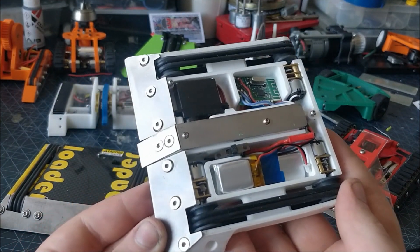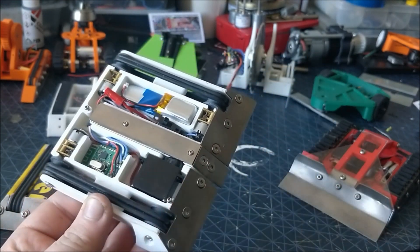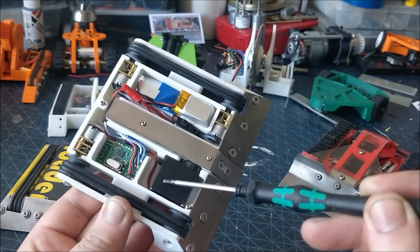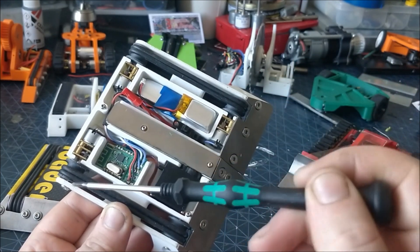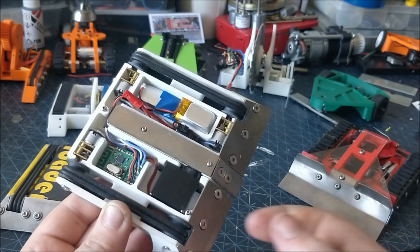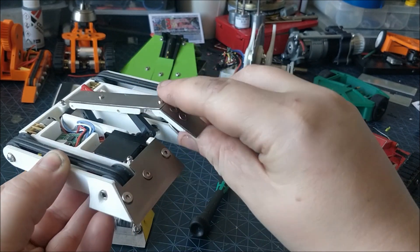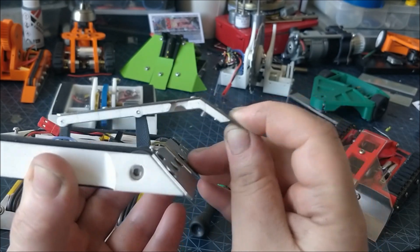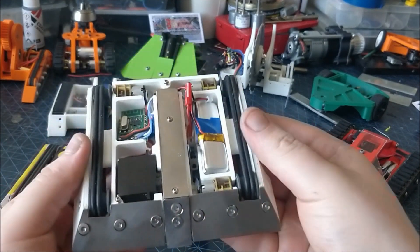The prototype is formed around some fairly simple components: the Malenki Nano ESC receiver combination, a 7.4 volt servo from the BBB Web Store, and three drive motors which are custom N10s driving silicon tracks, along with some 150mAh LiPo cells to power it. The weapon is a 4-bar lifter similar to Biohazard and Storm 2, with an interesting motion — it throws up and forwards instead of just up or just forwards.